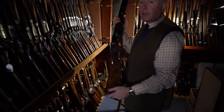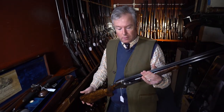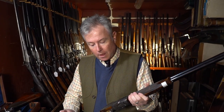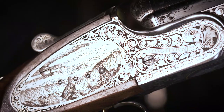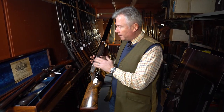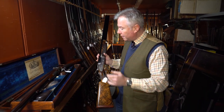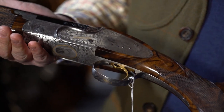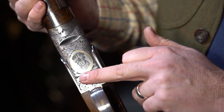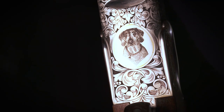This has been taken to another level entirely by laser engraving, which is relatively new to the market. Here we have a pair of guns by Longthorn, an innovative English manufacturer who have only been in business for about 10 years. They use a lot of technology — the barrels are made from one solid piece of metal, CNC machined. The engraving gives all the impression of being hand engraving of the highest quality: it's a beautiful design, impeccably finished, but it is actually engraved by laser — a computer program has engraved this gun. This is a great move forward for manufacturers, who can design a pattern and repeat it ad infinitum and easily embellish or alter it to a customer's specification. On this particular gun, the owner's Labrador has been engraved on the base.